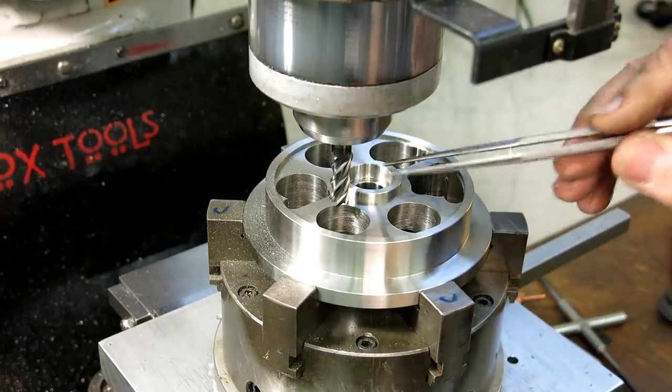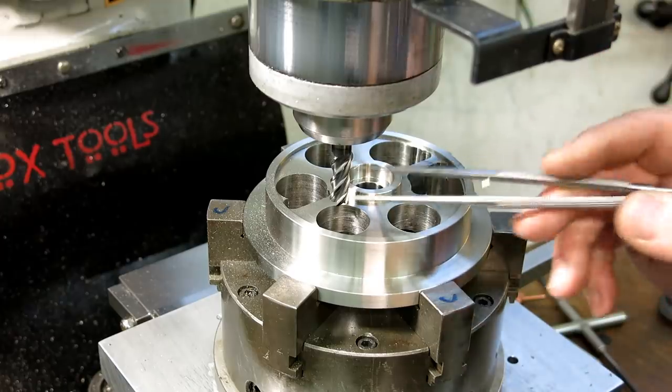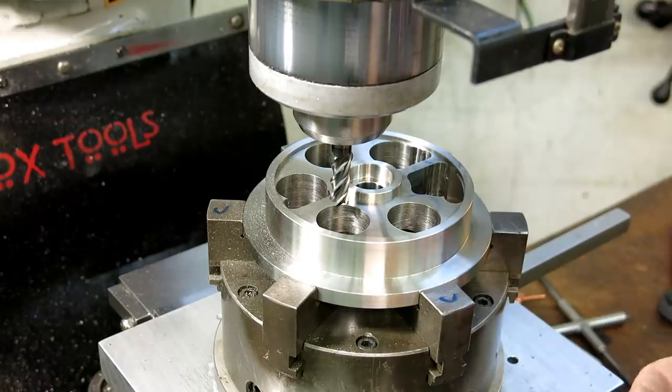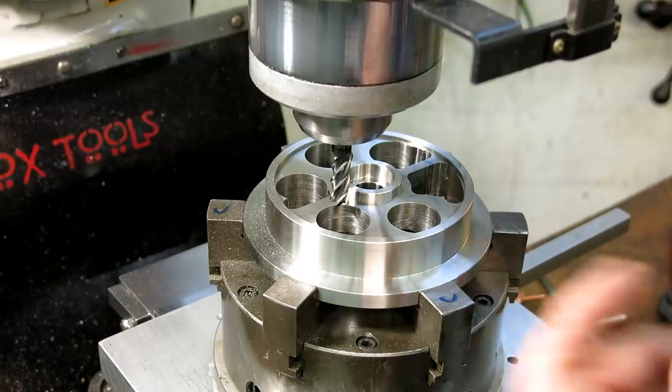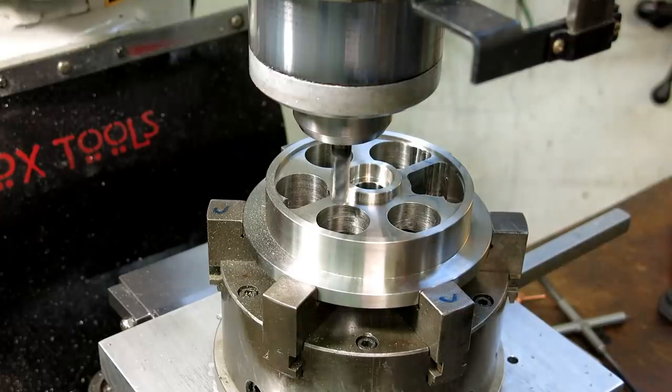What we're using here is from my buddy Dennis Nolan of Niagara Cutters. This is a special end mill called a stabilizer, and he's kind of personally responsible for a lot of the design work around it. It's a variable flute geometry that reduces chatter and has better chip evacuation. We're probably abusing the hell out of it here, but it's working great.